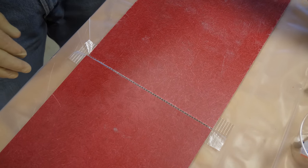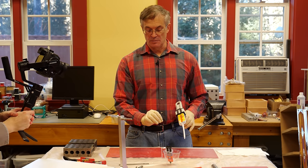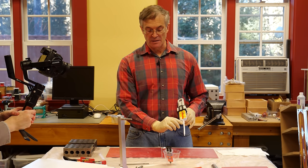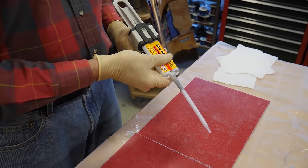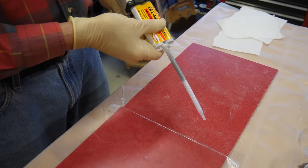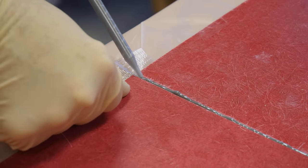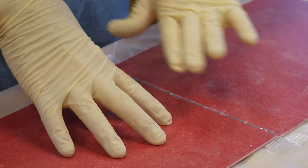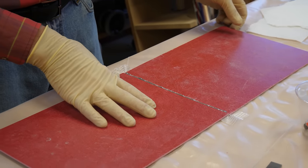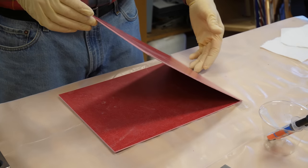The thickness of the material produced a very even gap. I'm going to take advantage of this toughened epoxy — you can make your own with a two-part epoxy by adding some aluminum powder, but this is very convenient because it has premixing and a nice nozzle that allows me to feed it into the gap. So I'm going to inject a little bit of this into the gap between the two parts. Now if I were to close this right now with no epoxy in here, it would just slam shut. But if you look carefully as it gets very near closing, you're going to see the upper panel sort of decelerates as it falls down — one, two, three.